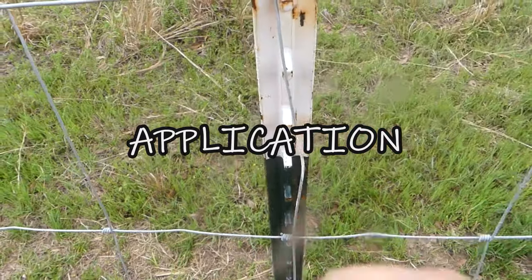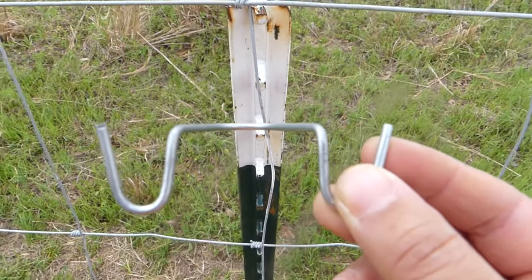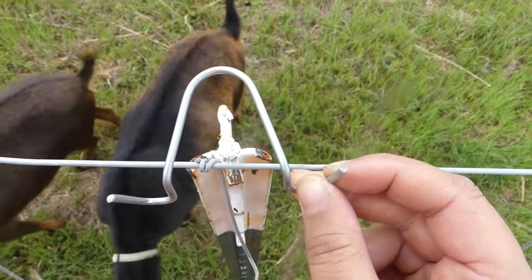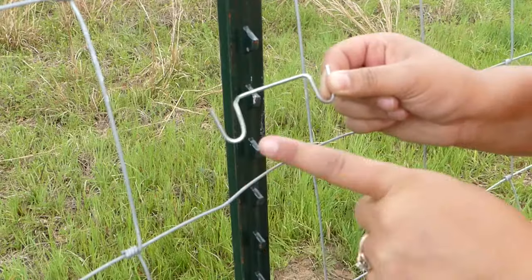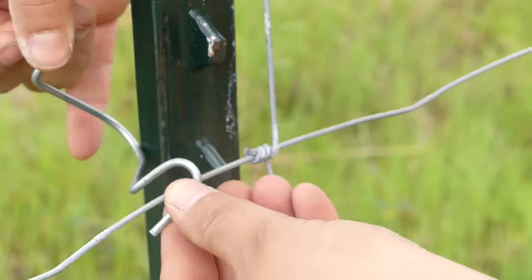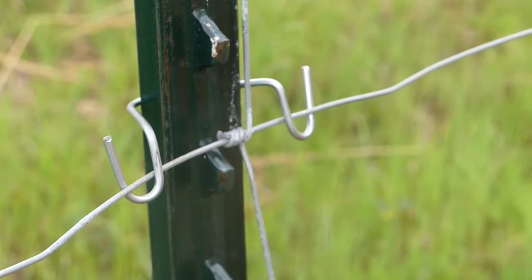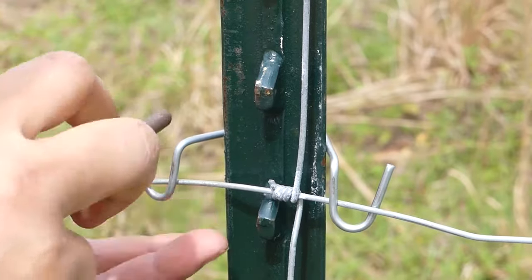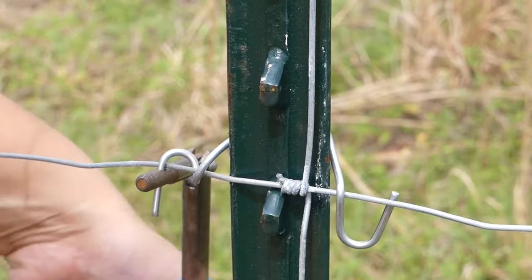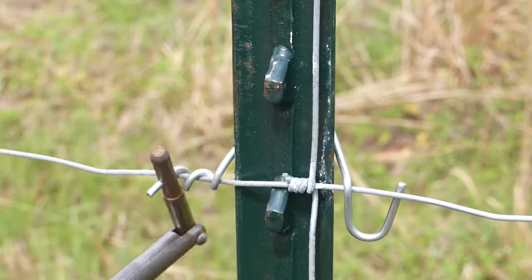Your clips are going to go on in this direction. You've got the U side, which has two little U's on either end, and then you have the angle side with the triangle that's going to go over the base of your post — it fits just like that. Take your left U side, reach around your post, and grab hold of the wire. Look at your right U side and grab hold of the wire. Take your tool and slide it on top of your left U, push down and away from you, slip it through the fence.